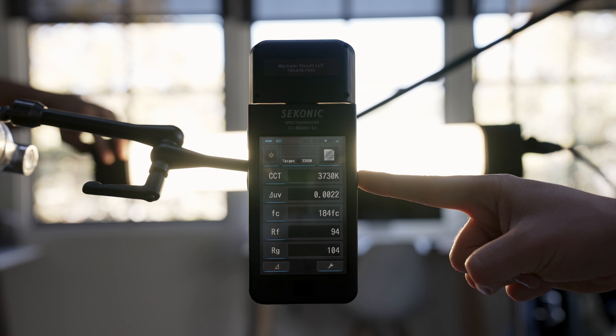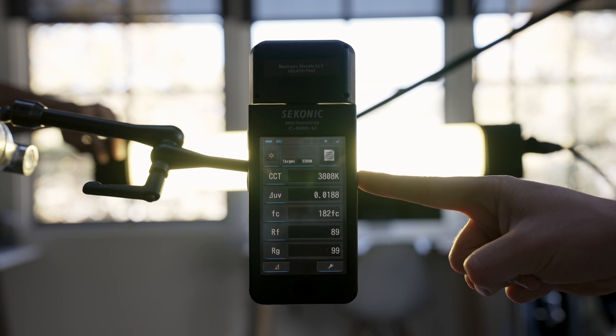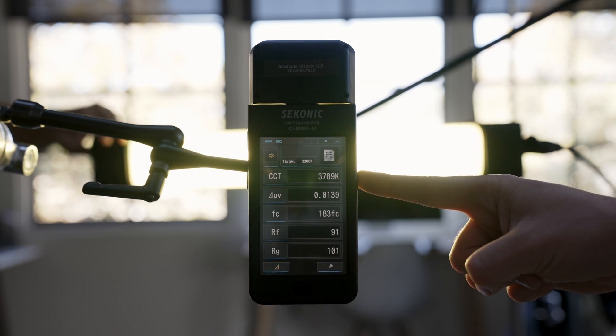Most of you know the typical plus or minus green adjustment on RGB lights, and another neat thing these lights do is maintain your color temperature as you add or take away green. Some lighting manufacturers will just blindly add in the green diode, which is not accurate and will start affecting your color temperature. This is something I constantly run into when dialing in Delta UV on RGB fixtures — as I'm adjusting my plus or minus green, I'll constantly have to readjust my CCT because the color temperature has shifted.